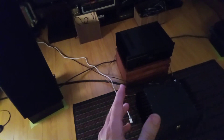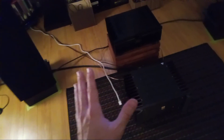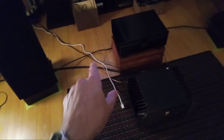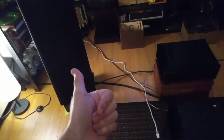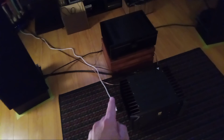I won't bother recording it, but I can tell you it is dead silent with that cord and that filter in it. It depends on the design — some stuff has that built into the way they do the ground network in the chassis and you won't have that issue. But if you do, usually crackling like that is a sign of a connection issue, but not always. In this case, it's a ground problem where noise is getting in through the mains ground and working its way into the signal path to the point where it's audible on the speakers. Hopefully that helps somebody out, because I really had to figure that out on my own through experimentation before I determined it wasn't the equipment — it was my power supply, and that was the way to get around it.